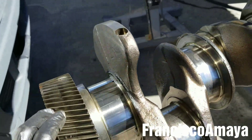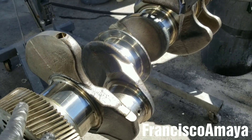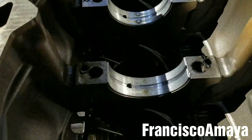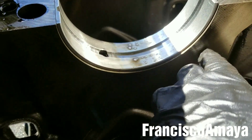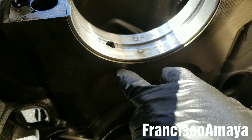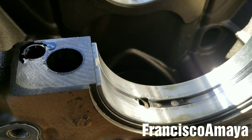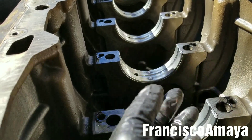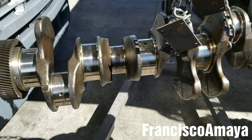Now what I have to do is get the new part to install. New bearings, new main bearings, and I'm also going to install new main bearing bolts — that's very important. Also, something I want to tell you to do if you do this kind of job: check the block in these areas, because I have seen some occasions where it cracks in some areas over here. If you find that your block has a crack somewhere, do not reuse the block — you have to replace it. Inspect it carefully, because if you don't and you put everything back together, the main bearing is going to spin and cause major damage. After spending $25,000, nobody will be happy about that.